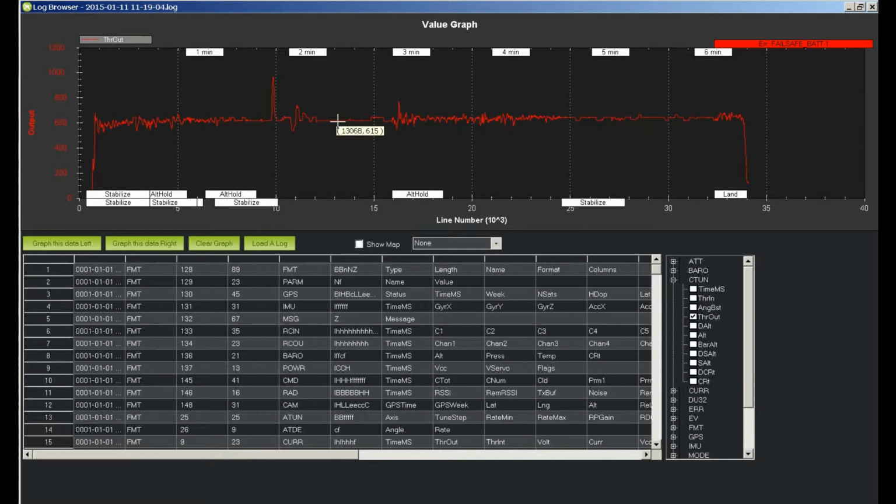See, I'm setting the mid-throttle at 615, going 0 to 1,000 on the throttle. I'm setting it at 615 is where it hovers, because the platform with the video transmitter and the camera on it now is a little heavier than it was. It was hovering really close to 500, which is 50%. But now I've got that. I've got my vibration out of my frame to the point where I've never had any platform so far. I'll go back and change the other ones soon, the Flame Wheel and the X650. I got my platform where my autopilot is extremely vibration dampened from my frame vibrations.